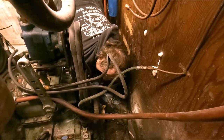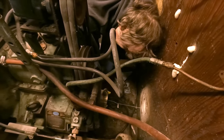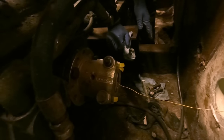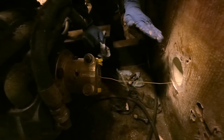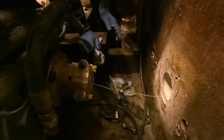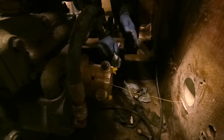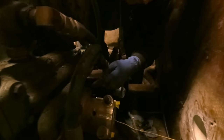Now during a normal engine alignment, this is what you would actually be looking for: any gap between your two faces on this flange. In this case it's not going to really matter for us, because we're setting our bearing blocks and our bearings off of this line, so all this stuff should be really good to go right off the bat. But say you removed an engine or put in a new shaft and you're going off the old bearing blocks and something changed, this is what you would be looking for, and you'd want to use a feeler gauge in here to make sure that this gap is consistent all the way around